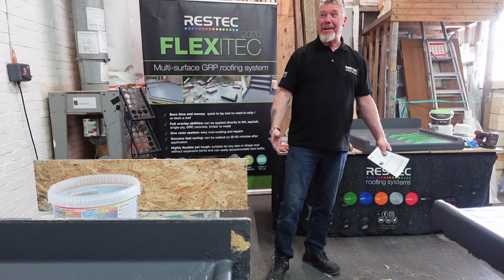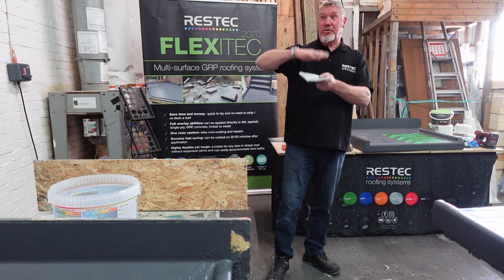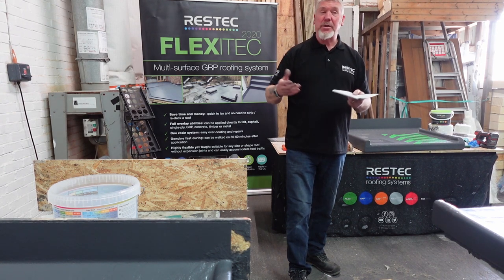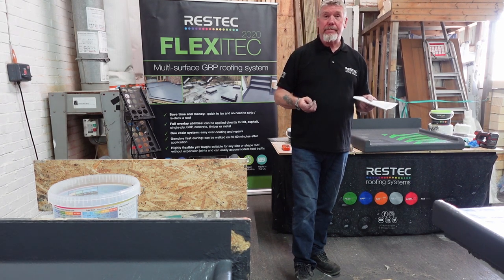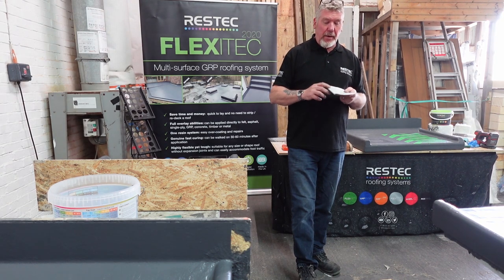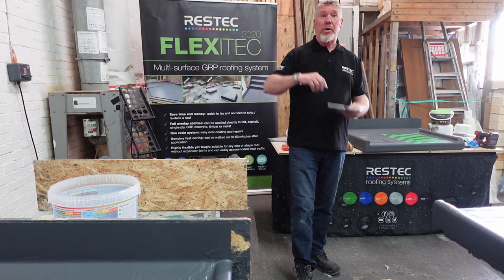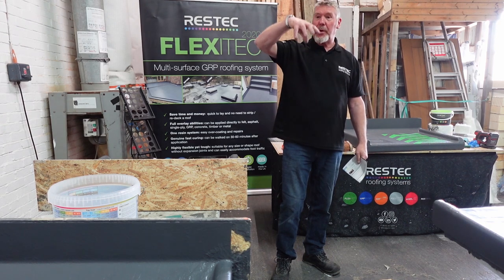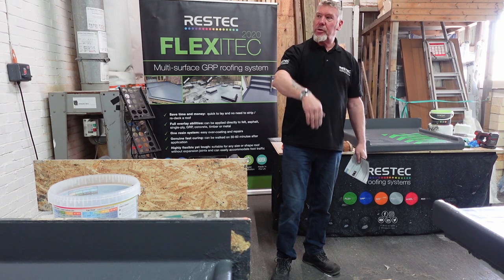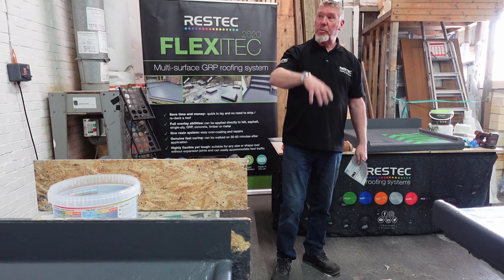Okay, so it's not bouncing, it's the fact that the insulation there has just gone all soft because it's soaking wet through. If you've got soft insulation, wet insulation, really it's got to come off. Don't trap moisture in there, take it all off, start all over again. The core test basically tells you that, so what you do, you're going to drill a hole into the roof with a core driller or hammer and bolster chisel, fine, get right down to the substrate. That will tell you what the substrate is.